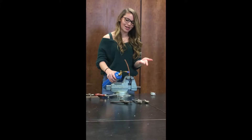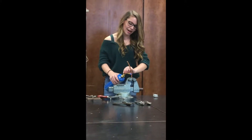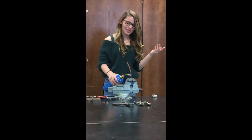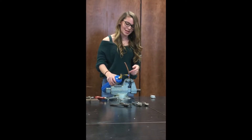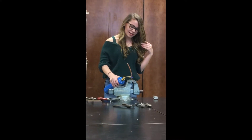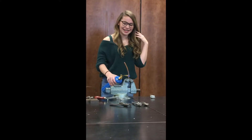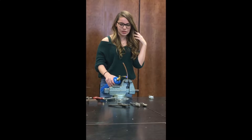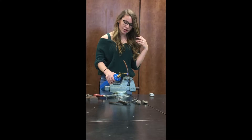I tried to work at the base because it's harder to heat up — this will get hotter easier. It does have to get red hot for it to work. This is called annealing; it just makes the copper softer. It works for most metals. You do this a couple times during the process just so that the copper bends easier and textures are easier.